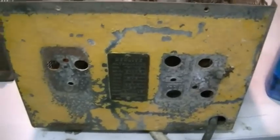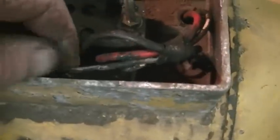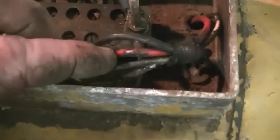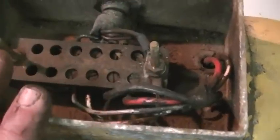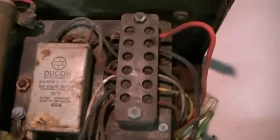I've just taken the lid off the yellow box and it would seem the mice have moved in, so I'm going to have to give this a really good clean. This is the lid off of our generator itself. Coming from the generator we have a thick black and a thick red wire, but we also have these two white wires here — that was what I was hoping to see. That would be the exciter circuit for the generator, to crank the magnetic field up. The only problem is it's not confined in a generator as they are today — it actually goes over to our second unit here, which had our mouse nest in it. This is very old equipment indeed.